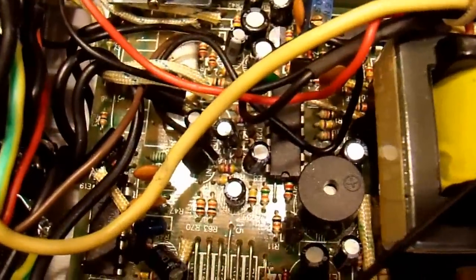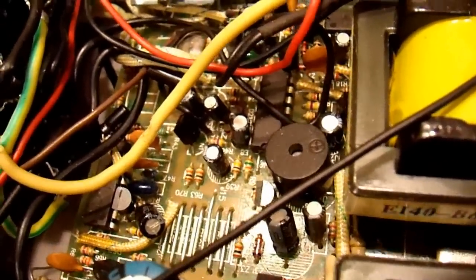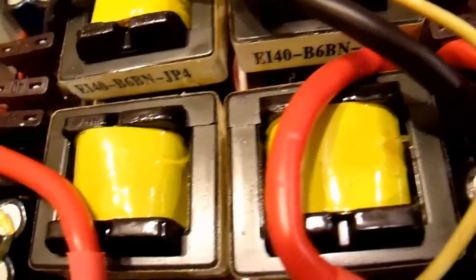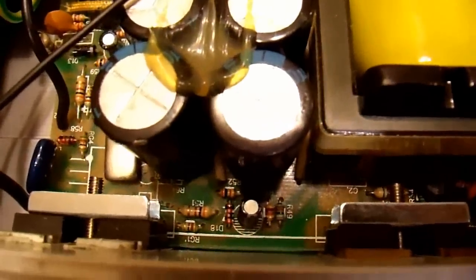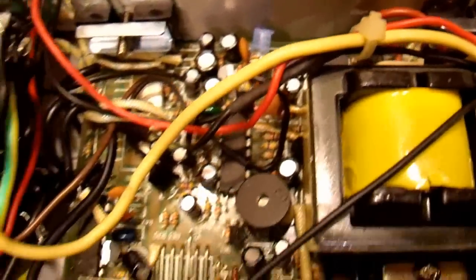One last thing: it's extremely dirty. This thing is pretty filthy, and it looks like it's not environmental dust — it looks like residual flux from manufacturing and other crud like that. That probably won't affect function much, but it does mean the board is going to corrode quite quickly because it's already contaminated. What I might actually do is take some electronics cleaner and hose this whole thing down to clean all that crud off. That should keep it from accumulating dust and potentially getting solder bridging and other corrosion-related failure modes. But there's the inside of it — I can't say I'm happy with it, but we'll move on.